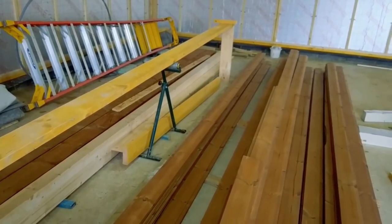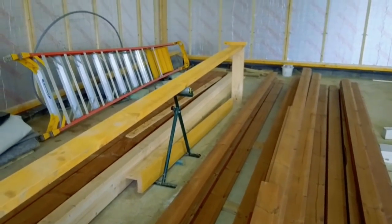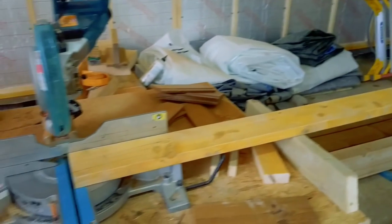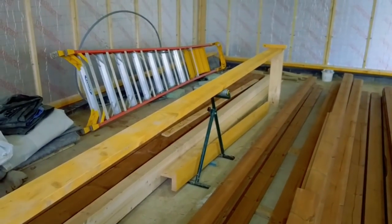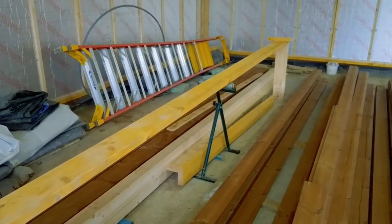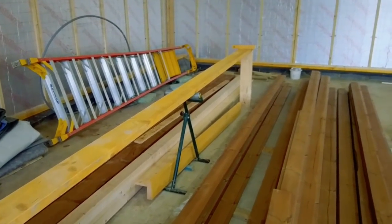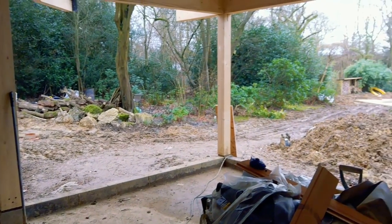The last thing I want is to be cutting it all back and having loads of offcut and waste. The cladding is 5.1 metre lengths and this side is about 4.650m, so with the contraption everything's fixed together and there's a stop on the end. I put a square end on, flip it around, and chop it to length — it's fantastic because I can just cut and fix, no messing around, no measuring after the first piece. It speeds the process up — I'd say it's double as quick. Just thought I'd share that before I carry on — looks like it's going to rain!